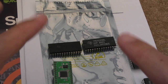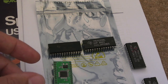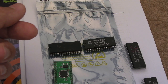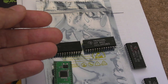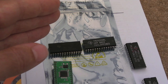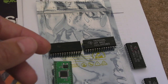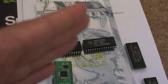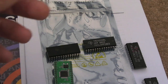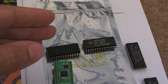It uses something called pitch-excited linear predictive encoding. So I think what's meant by that in sort of layman's terms, if you think about the speech chips we looked at in the past on the Spectrum and various other systems, perhaps works a similar way to that, where you get certain parts of the sounds that come from the vocal tract, and they've got an encoding for those common patterns. And then the pitch excited bit is a way to perhaps affect those with pitch. So the idea being that you can use those little bits to join up to create words and sentences and stuff, and then use your pitch excitement. Is that really a term I've just made?